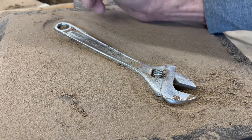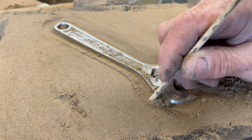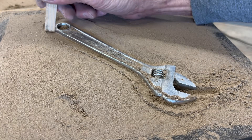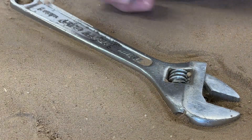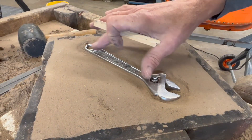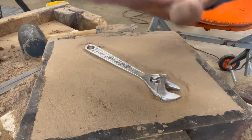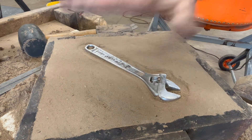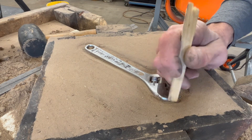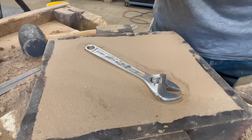Okay, we've got a different angle now — carving in. I'm going to come right down with this, just a piece of stick. I've opened it up a little bit just to try to get that in there and get a sharp edge through there for the other half of the mold to match to. It doesn't really matter that this is all over and up and down because when I put the cope on, we'll put more powder and it's going to mimic everything that I've just carved out. Pack it around a little bit more — that's good enough because we don't have all day, it's already taken too long.